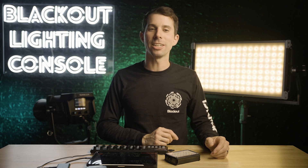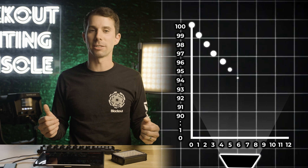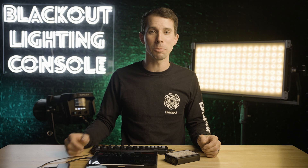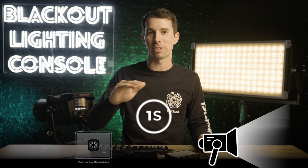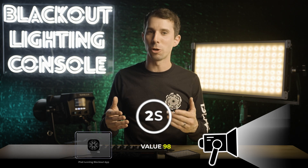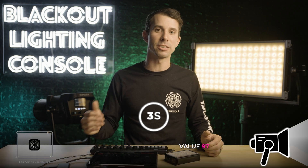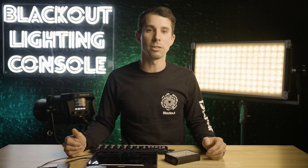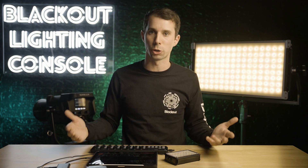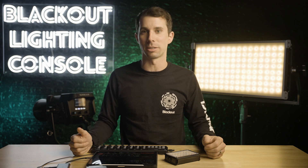But we're talking film here and things change on a dime. What if you need to do a 10-point fade over 10 seconds? If you did that in 8-bit, that's 1% every second, meaning you would constantly be sending many of the same DMX values until it dropped to the next value. So even with DMX smoothing on, it would probably look choppy. If you did this in 16-bit, you would be changing values every step and it would look smoother. Plus, what if you need to be in between an 8-bit step like pan, tilt, or hue, which are all in degrees? 360 degrees is more steps than an 8-bit channel can handle, so anything like that should definitely be in 16-bit.